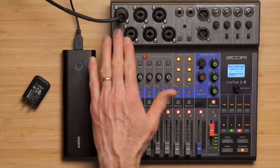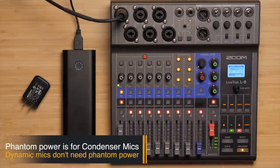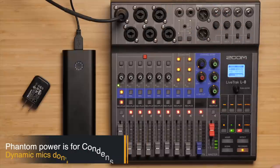there's a single switch that turns on phantom power for all six of the inputs. So if you were going to use a microphone that's sensitive or doesn't accept any sort of phantom power, like a vintage ribbon microphone, you'll want to be really careful with that.